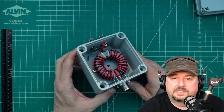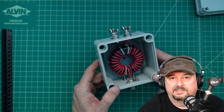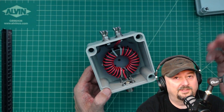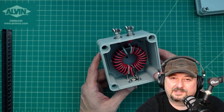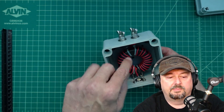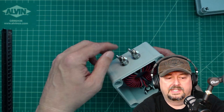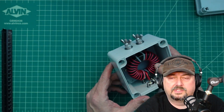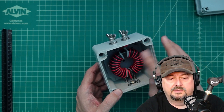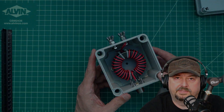In this video we're going to take a look at how I built this one-to-one choke balun. I know people are going to get upset because I called it a choke balun - you can call it a balun or a choke if that's what you like. This is a one-to-one choke I'll be using at the feed point of a doublet antenna that's going to use twin line or ladder line. It should choke out any common mode currents in a one-to-one configuration.